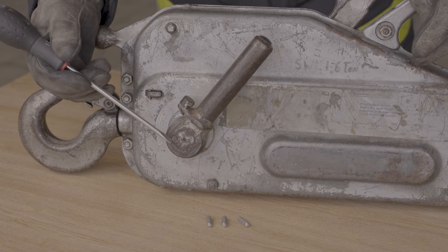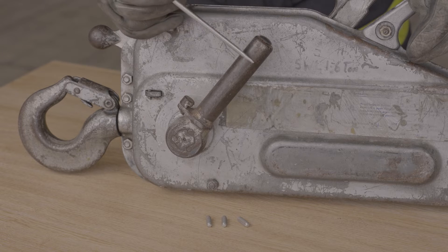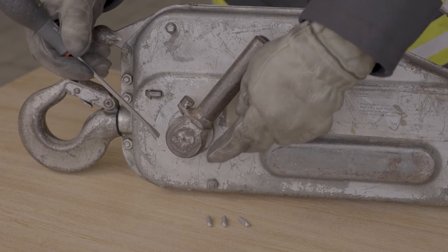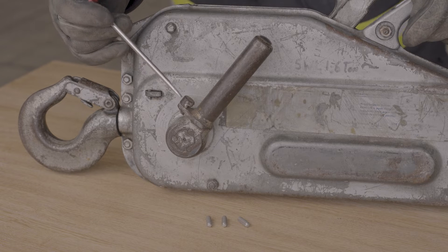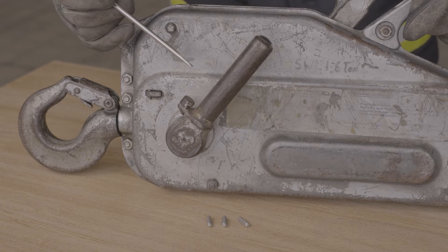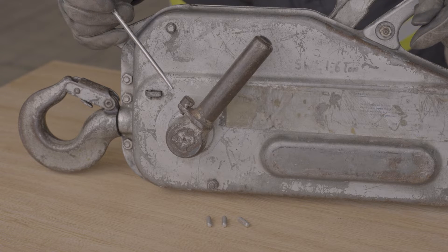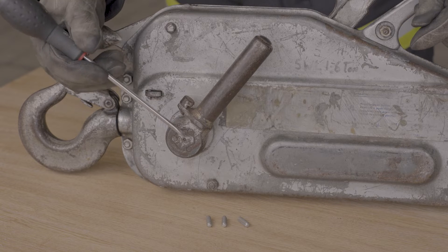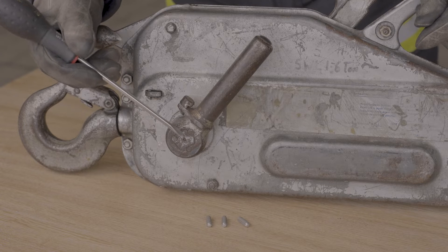When the pins shear, we remove them with a suitable punch, and then we're looking to remove the forward operating handle stub in its entirety using any sort of extractor — just remove this whole stub once the pins have been punched out. Clean the recess — have a look around and clean it all up. Then refit the stub back onto its crank, lining up the grooves, and tap the shear pins in lightly. Afterwards, drive them in with a small hammer. That's all your shear pins relocated and the stub back on.